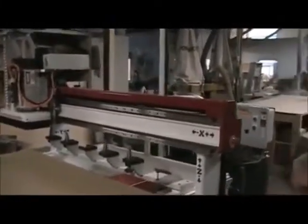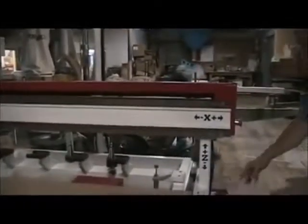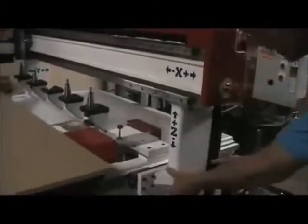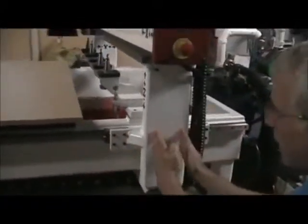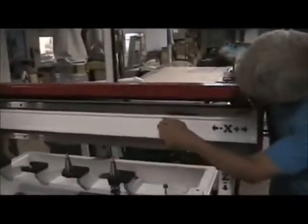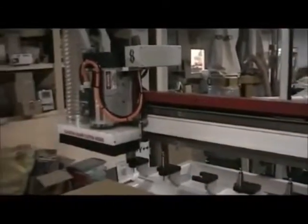We're not mixing metals together, and we're not doing a lot of bolt together. If you look at these column uprights, what you can see is that it's a solid steel weldment. We put gussets in the corners and we spread the rails out — by spreading these bearings out a foot, we give a lot of integrity to this bridge. Same thing up here on the gantry: we weld steel plate onto the tube, then we machine that for attaching profile rails, and this machine has profile rails on all axes.